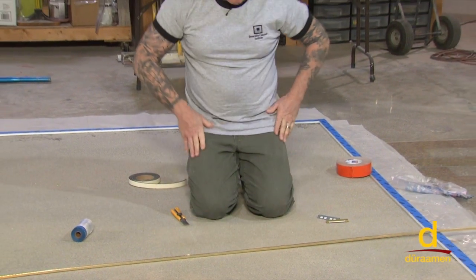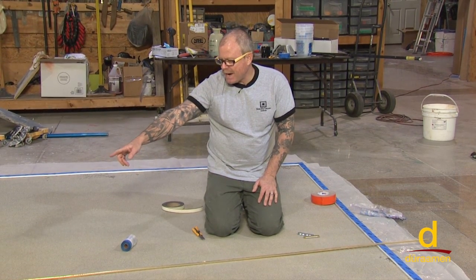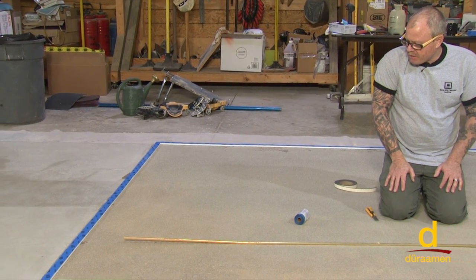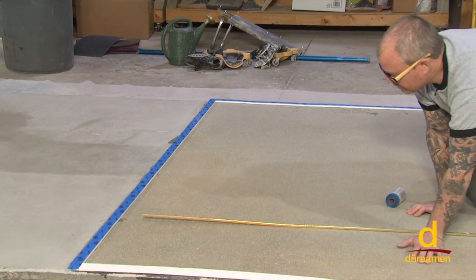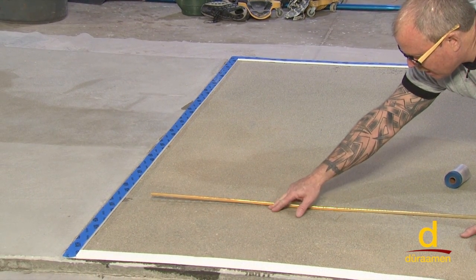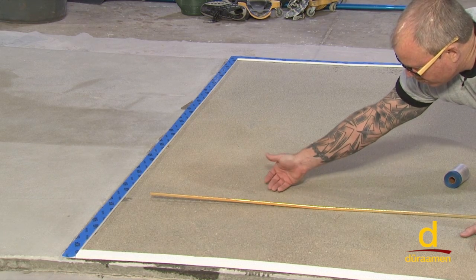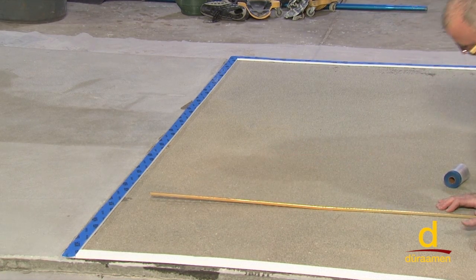Regardless of how you stick it to the floor, what you have to be concerned about is that the rail is in fact set level. If you pan over here to my right, your left, you'll notice, this is an extreme example, that one edge of the rail is sticking way up in the air. In that scenario, you would have to take a builder's level or a laser level and make sure that you shim areas, so that your rail is set level despite what the concrete is doing. It appears that there's a big hump right here in the concrete and a low spot right there, so here you would have to shim it. Now you've got this gigantic void where the overlay would just go under, so you'd want to silicone this side so you don't have a void where the overlay cement escapes into.